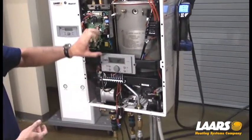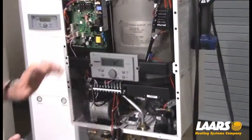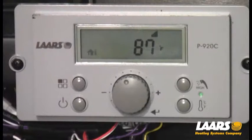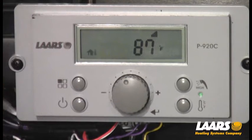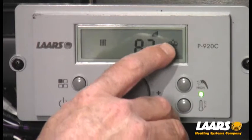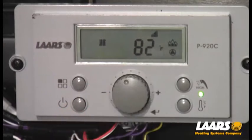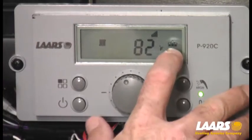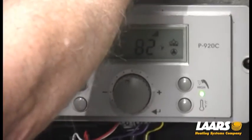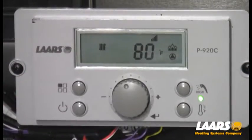With the wire disconnected, we power the boiler back up. We're registering 87 degrees — that's the tank temperature or heat exchanger temperature. The outdoor sensor symbol is flashing, indicating the sensor is disconnected. I'm going to give the boiler a call for heat. A flame signal has appeared on the screen along with a radiator symbol, which tells us we're in central heat mode and have a flame signal. You can also look in the sight window and see the flame appear.